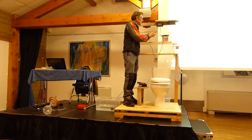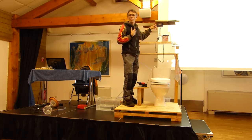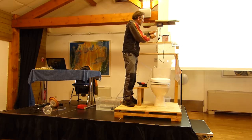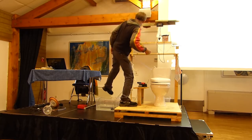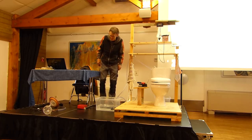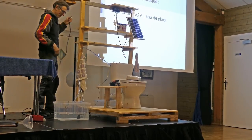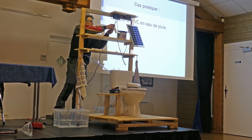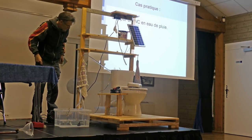You connect the battery to the régulateur first — I can see 12.2 volts — and then you connect the solar panel. And that's how it works. Then the idea is to connect the pump to it, which is fine because the pump is 12V and the battery is 12V — it works perfectly. I'll let it run.